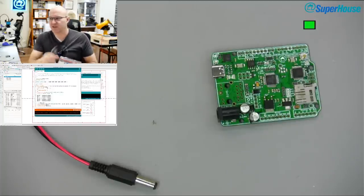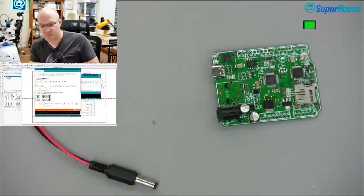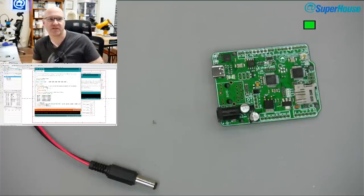So the thing is that thermally stable solder paste doesn't mean that you can expose it to air for a long period of time. What that means is you don't need to store it in a fridge, although it is still better if you do. So there are a couple of different things. One is storage temperature: with different types of solder paste, some you refrigerate, some you don't need to. And the other is its lifetime once you have put it onto the board before you reflow it. And that's what that 24-hour solder paste is referring to.